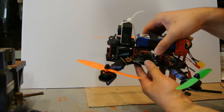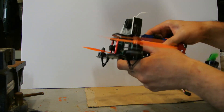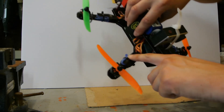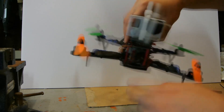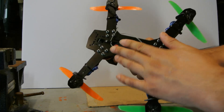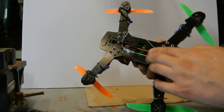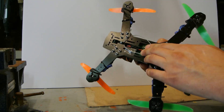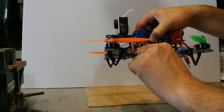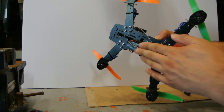The KK2 fits. I mounted it with some anti-vibration foam tape and zip-tied everything in. I could probably trim some weight by shortening some of the wire leads. For power distribution, I just used wire — I had ordered some tiny power distribution circuit boards, but there wasn't a good way to mount them without adding a standoff to the frame, so I just ran the wiring underneath and kept it nice and flush so nothing really catches.